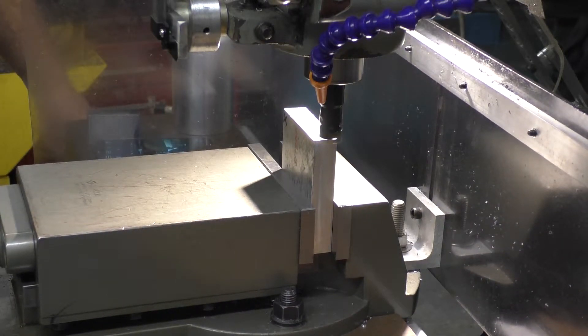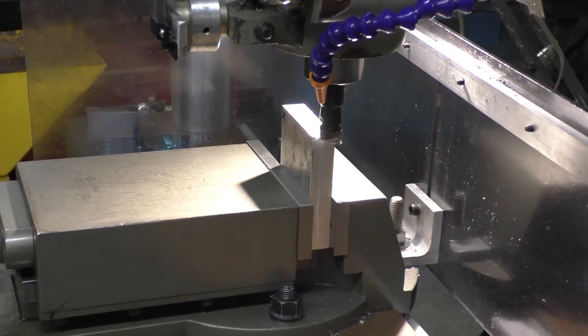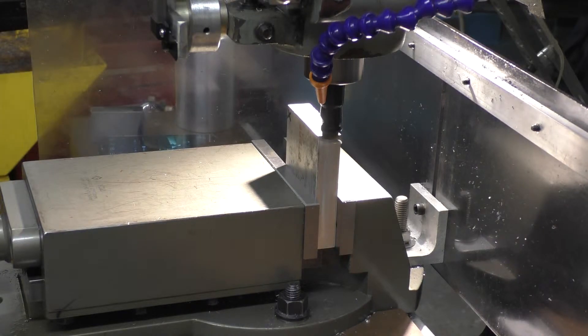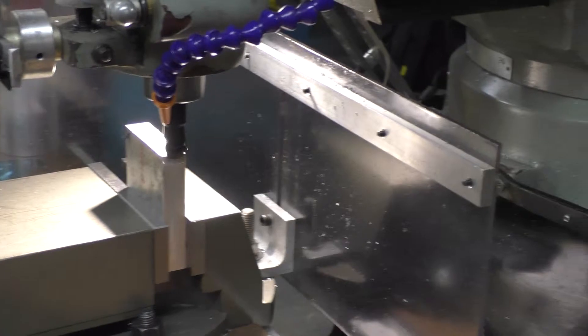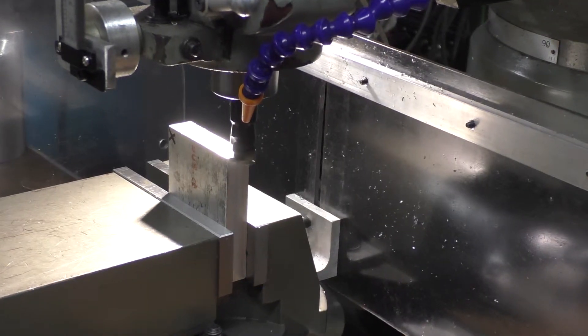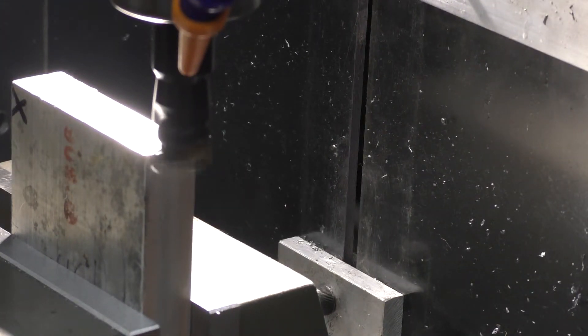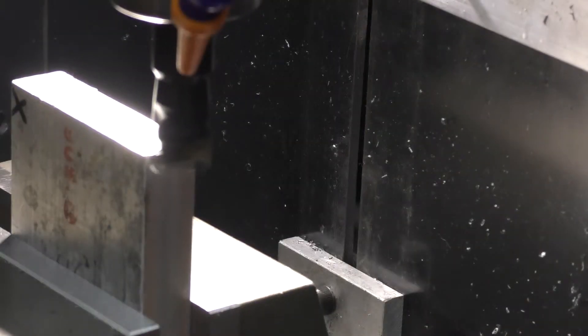Get a touch off — I'm running this at about 1000 RPM. It's a small end mill, they call it a little hogger or something like that; there are so many different ones out there. We'll take the outside edge first, block the table off here, and I'm just going to move you out and give you a little zoom in.